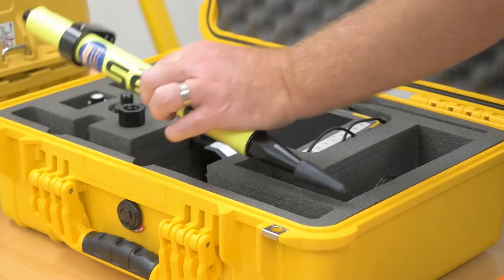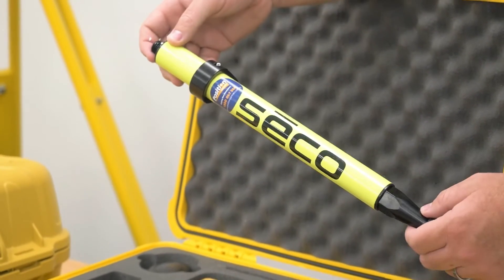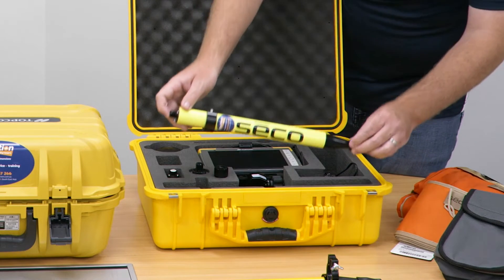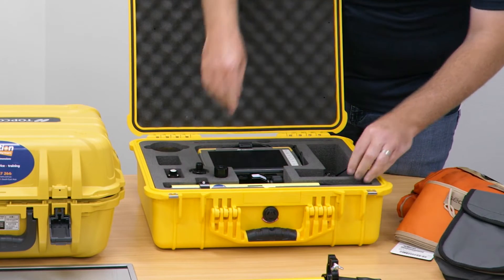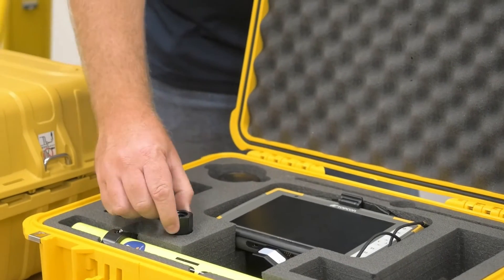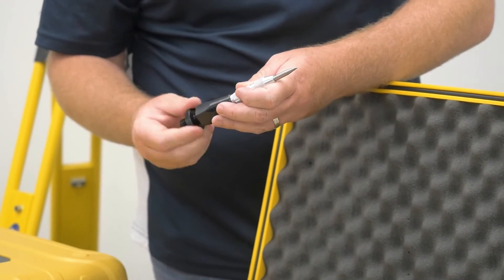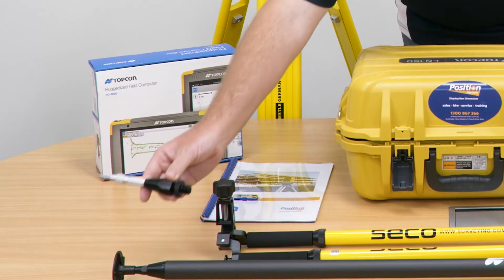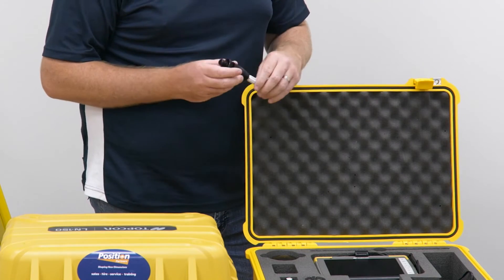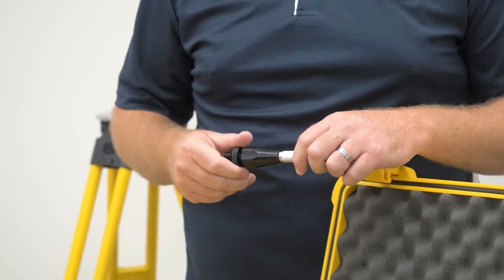In the front here we've got our mini stakeout pole. This is used for doing high accuracy set out — say hold-down bolts or penetrations on a deck. If you're chasing those millimetres, definitely want to look at one of those. Next we have our adapter which fits to our concrete centre punch. That mounts to the bottom of your prism pole, and if you're doing set out on a slab or on a deck you can put a little bit of weight on it, activating the centre punch and leaving a nice little mark.